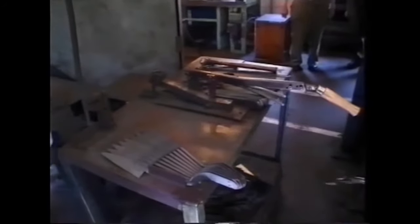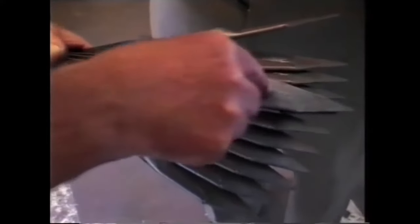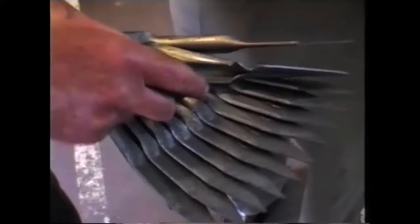Here, the operator is making sure that the hollow fits the gauge, or vice versa, the gauge fits the hollow. If he's satisfied, he'll carry on, but he'll do this test about every three dozen blades. That's where the mark is — you've got to see that the mark is good enough. That's where he's hollowed them, so that has got to fit the hollow machine.